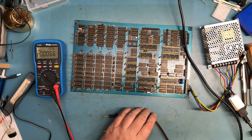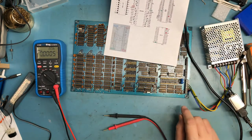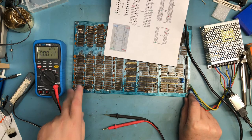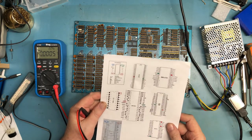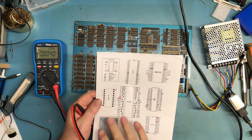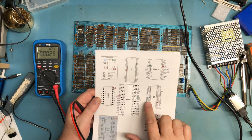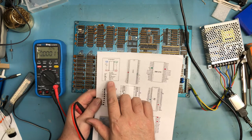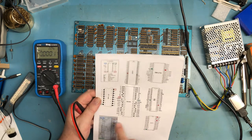So there's multiple voltage rails required, including a negative 5. And the negative 5 has to be being regulated off of the negative 12, I'm guessing by this Zener diode down here. I'm pretty confident that's a Zener sitting there. I could confirm in the schematic. But what that'll generate is the negative 5 that's required. So I've gone through basically devices where the pinouts are kind of odd, and I've captured red is plus 5, green is ground, blue is VBB, which is minus 5, and plus 12, that color printed poorly.